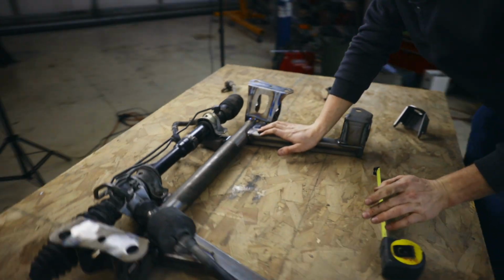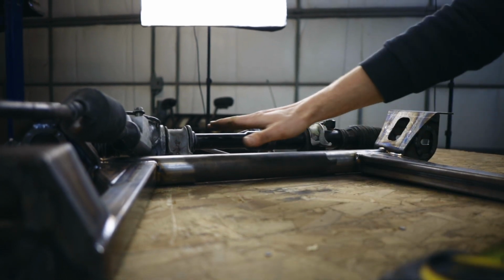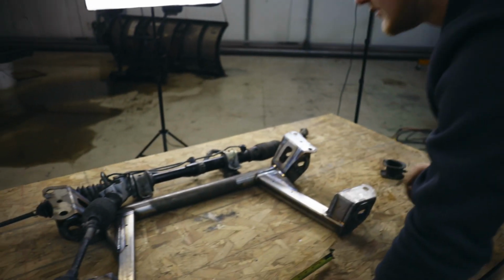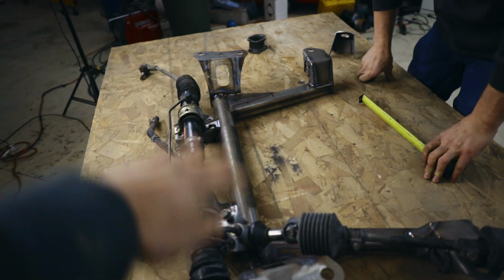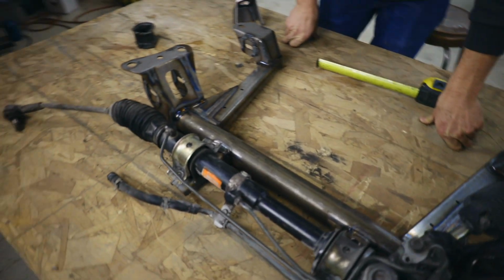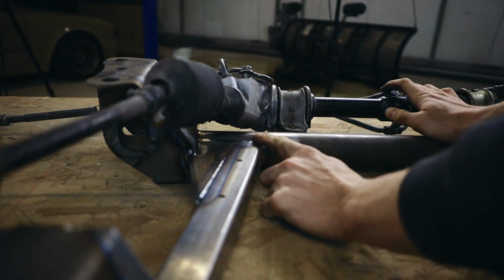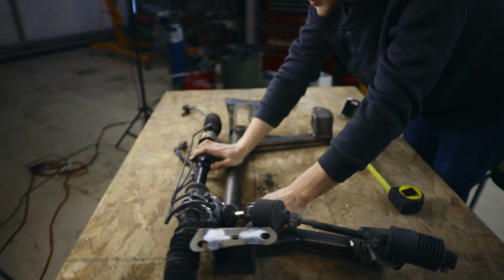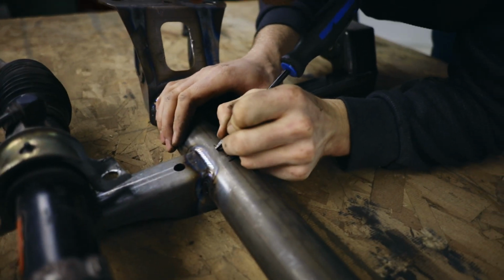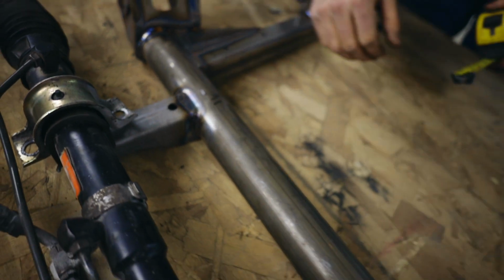Yeah, so if you take a look from over here, what we're thinking is that if this can be the tallest height, we can have the oil pan sitting just higher than this. So if we are able to lower the rack enough to be there, then we can just have the whole pan at this height. Yeah, that makes sense. So maybe what we should do is completely cut away the mounts that they have now, and then work from there, making our own mounts that sit below the subframe. Yeah, and then it looks like we'll also have to notch out part of the subframe here, because that's getting awfully close. But that's okay, we can reinforce that afterwards. Only other thing I'd like to do before that is mark the measurements of how far the holes are from the center, so that when we put the new mounts on, they can be the same forward-backwards position. Yeah, makes sense. Okay. Let's do it.